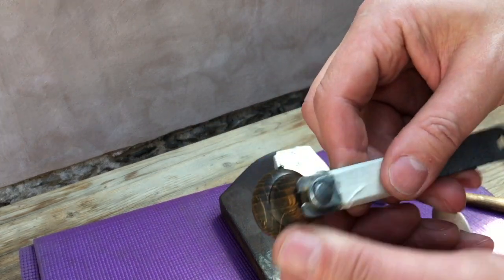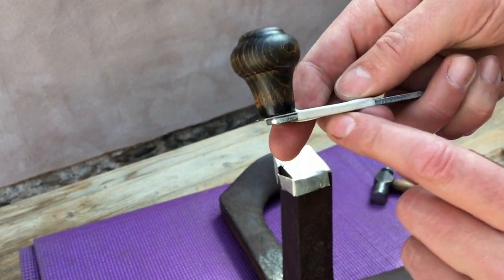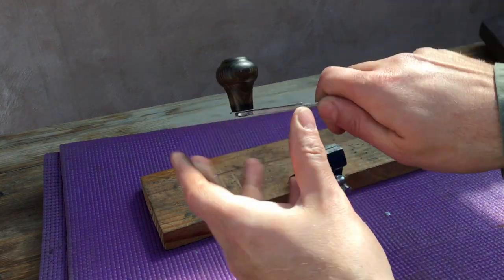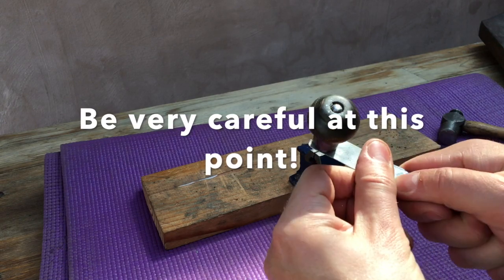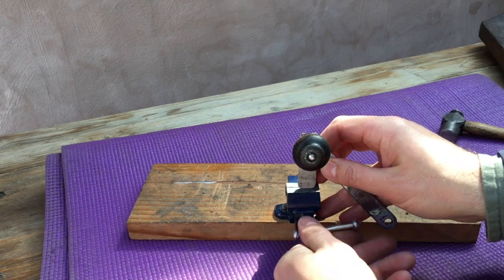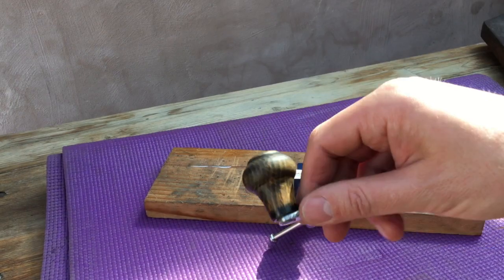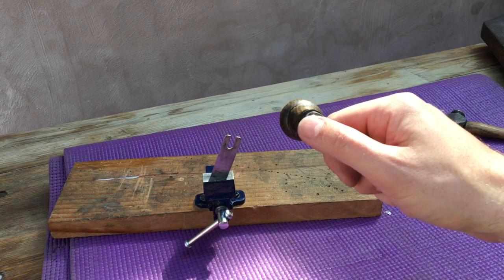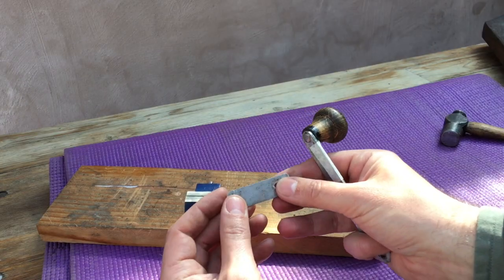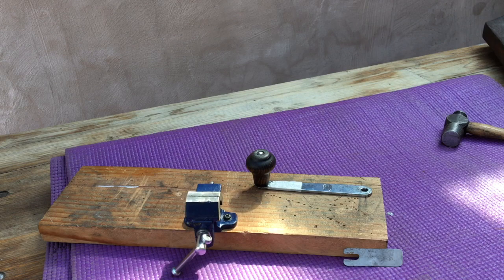I think that's done now. The next stage is to take the spacer out, which is not quite as straightforward as you'd think because it's now riveted in very tightly. We take the tape off — and you see it's going to be very tight. This is why you want all the edges to be round, because when you're trying to get it out it's very easy to cut yourself. So we're going to use this little model maker's vice to pull it out. And there you see — no more wobble! That's how to tighten up your loose pin attaching the handle. Just remember: give it the benefit of the doubt and do more peening than you think may be necessary. In most things less is more, but here less will put you in a difficult position. Also just keep safe — make sure the edges of your bits and pieces are rounded so you won't cut yourself. Thank you very much for watching, feel free to have a look at the links at the end of the video or in the description, and happy grinding!